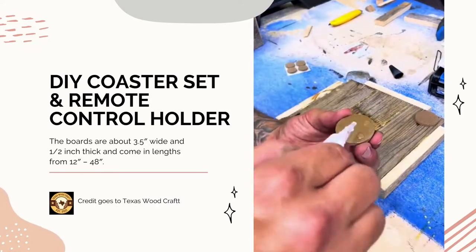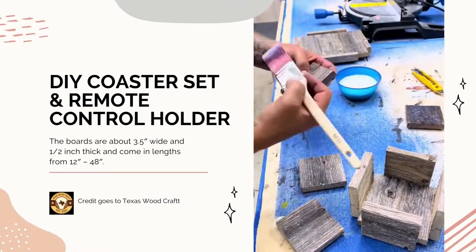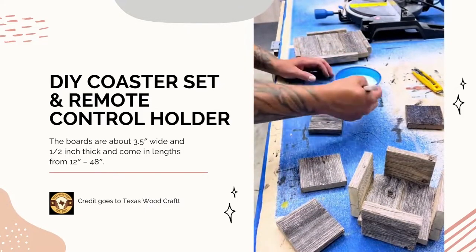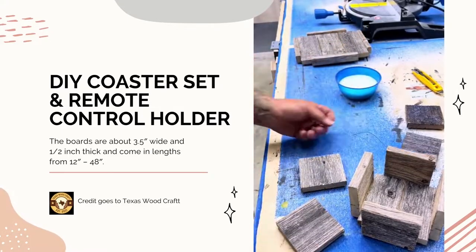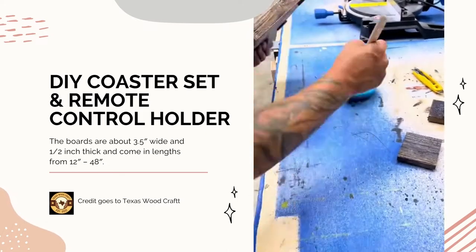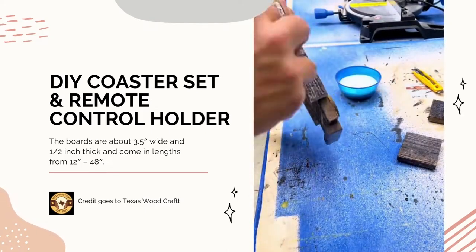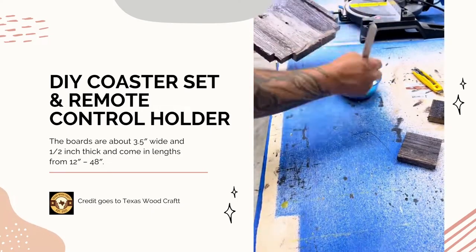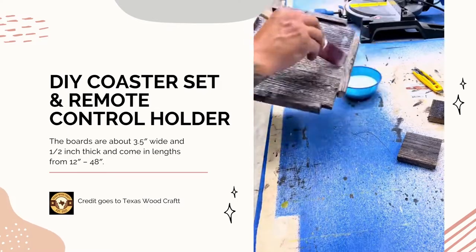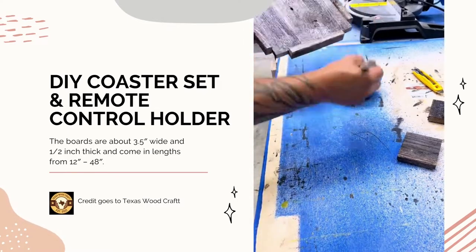After that I'm moving on to the clear coat — I'm using Minwax Polycrylic in a satin finish so it'll have a little bit of shine but not too much, and it will definitely be durable. I know you guys usually see me spray clear on everything, but because of how small these pieces are I didn't want to waste all that product and time doing cleanup, so I'm brushing it on and letting it air dry on my table.